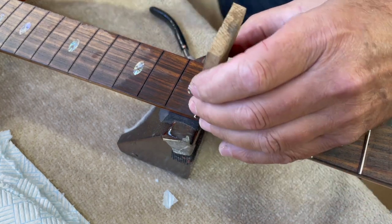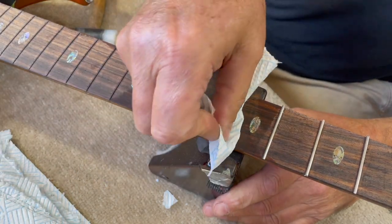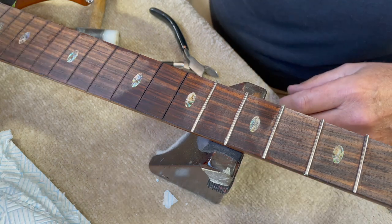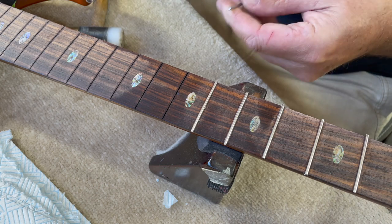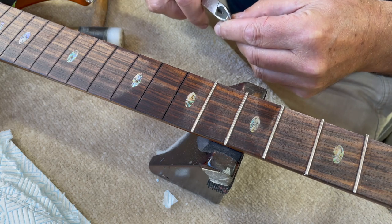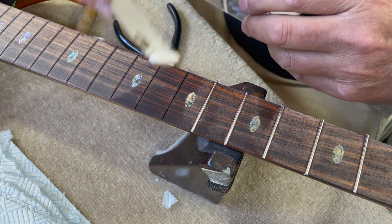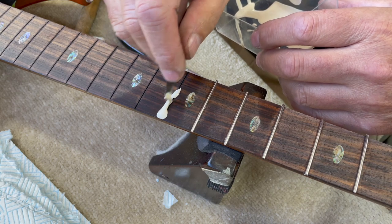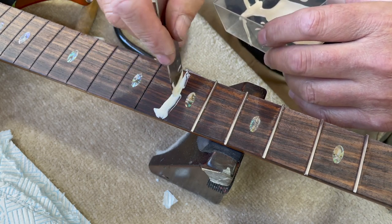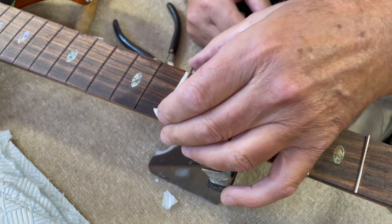So we had a choice. Did we put a nondescript neck on this body? And actually, I wasn't massively happy with the body anyway, even though it had worked in its first incarnation. So we got obsessed with this neck, and then I decided, well, screw this, instead of trying lots of different things, why don't I make the guitar around this neck, and we'll start with a poplar body, which is relatively inexpensive, or a blank. I'll make a body and then we'll mark it out and cut it for this unusual neck that came off a sort of super strat but has a 24 fret Gibson scale length, so that explains why it didn't work the first time. Anyhow, so that's coming up.